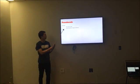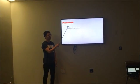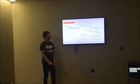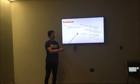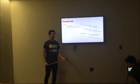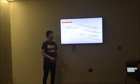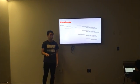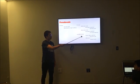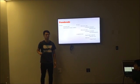We have our pseudocode here. During the setup phase, the bull starts off mad, and then it reads the baseline values for the light condition. During the loop, it first checks if the bull is calm, and if red light is detected, the bull is activated and set to mad. While the bull is mad, it will chase and turn towards the red light. If green light is detected, the bull will be set to calm. Otherwise, the bull will just charge forward.